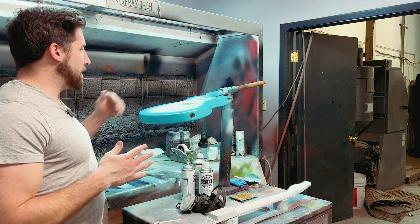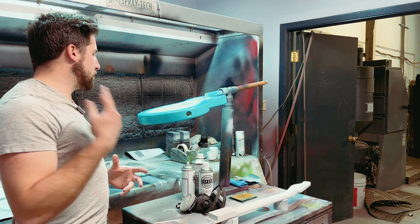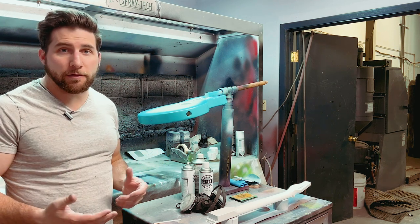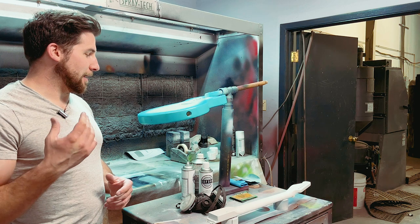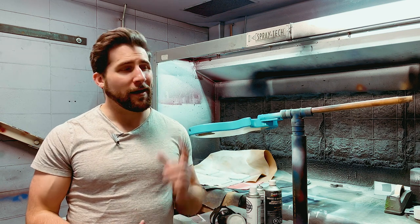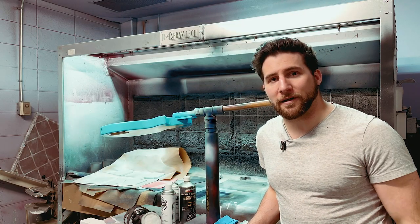Well guys, there you have it — that is how you do that, and it's looking pretty good. It would be nice if that were the end of the story. Sometimes I would do two coats and finish it up there, but I was looking very carefully while I was doing it and I did notice an imperfection I'm going to have to fix. So there's no point in doing two coats now and just burying that deeper. I've stopped — I'm going to wait a day, come back, sand that very gently, and fix it. Then we'll move on to assembling this thing. That's my tip for satin finishes and how to build them up. I hope you guys found this helpful. If you did, please give the video a thumbs up, and remember to subscribe so you can see how this project turns out — thanks for watching, see you next time!